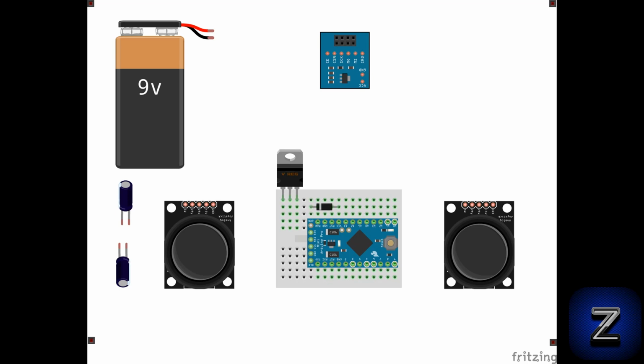Then, place your diode so the anode is connected to the VCC pin on the Arduino and the cathode is connected to the first open row of connections next to the Arduino board. The voltage regulator and diode are necessary for the NRF24L01 to function properly and reliably. It may work without these components, but it will have problems and not work reliably. Now we still have 2 capacitors to place on the board, but we will wait until later so they do not block our view of the breadboard.